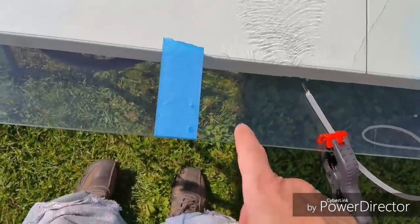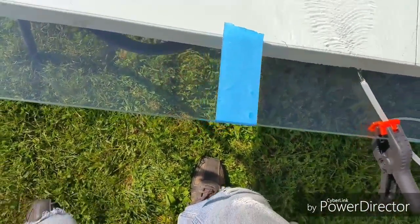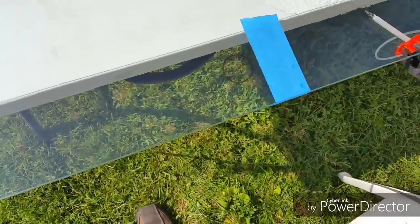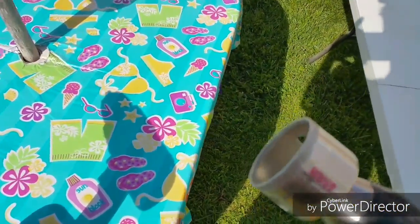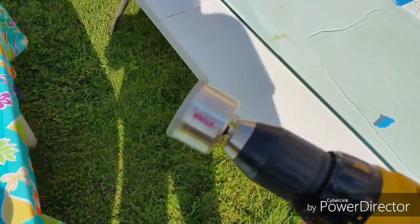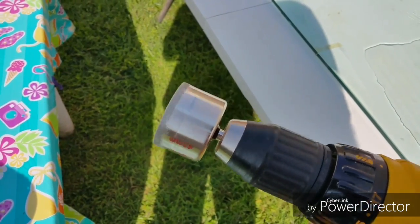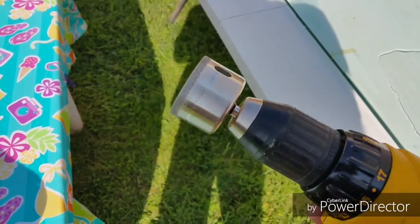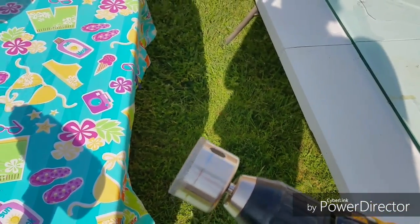I will have the water aimed right at the hole, but I noticed it started to take the Sharpie marker away, so I can't have that. Over here, I just have a cordless drill and a very cheap eBay bit on it. What you want to do is slowly turn your bit, make sure it's not wobbling on the end of the drill bit. If it is, you're going to want to try and straighten it, because you really don't want something hopping around on the glass.